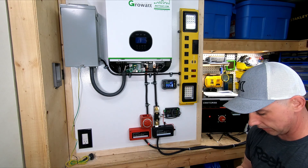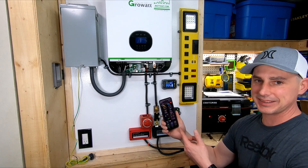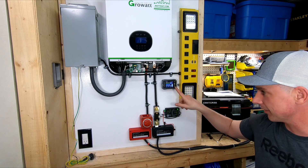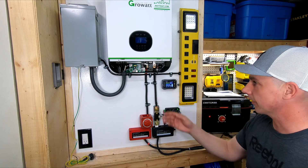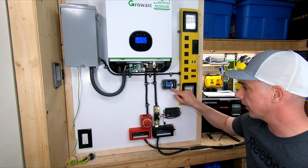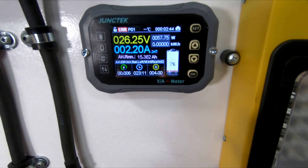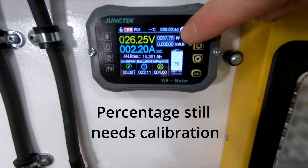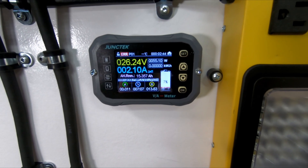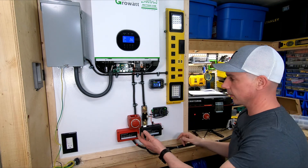Let's see if I can get on the app as well — there we go, I'm on the app. So I've got the app but I've also got the screen if I don't want to pull my phone out. This battery monitor system is awesome, I love it. Let's turn the load on — right now I'm using 10.5 watts, just went down. You can see here it just went up — I've got almost 60 watts standby consumption for this Growatt. We can turn the lights on — awesome. So there you go, that's the DC hookup.